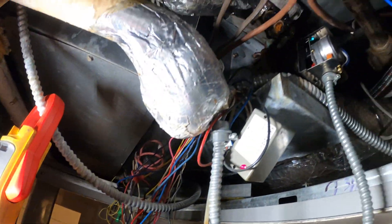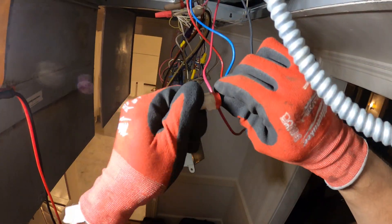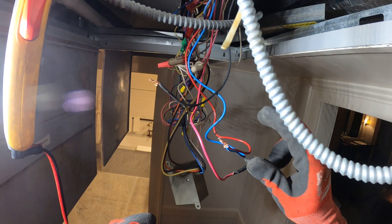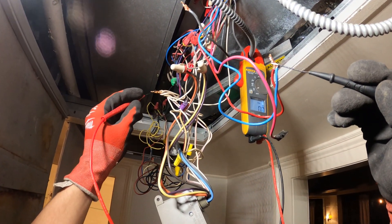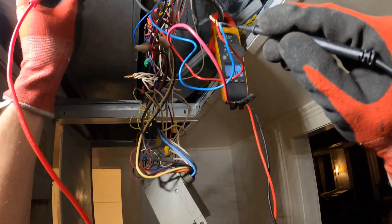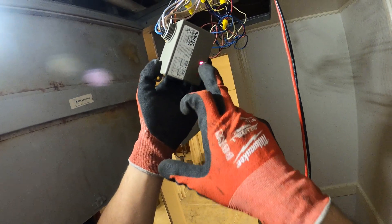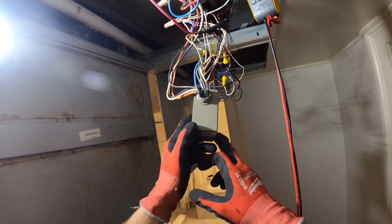Here's our black wire, and then the white goes to all the neutrals. It just disconnected. Got my meter on volts — that's neutral, this is hot. Let's check between these two, should be energizing. No power. I know the thermostat is doing its thing: when we call for heat this comes on, call for cooling this comes on. So what I have to do is trace out the wiring.